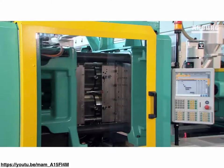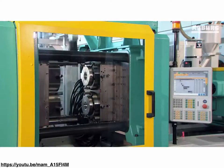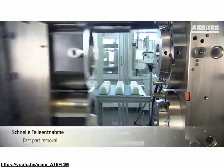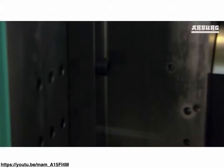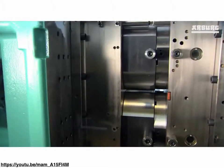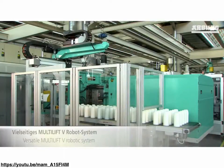Here's a video of an injection molding machine working. They're making some kind of little plastic cup — maybe for pudding or applesauce. The mold closes, plastic is injected, it cools, it opens, there's a container, the robot arm pulls them off, and it does it over and over again. This is how things like plastic water bottle caps are made — something like 75 per mold cycle, cycling every second or two. This is a much larger, more complicated machine than the one on the previous slide.